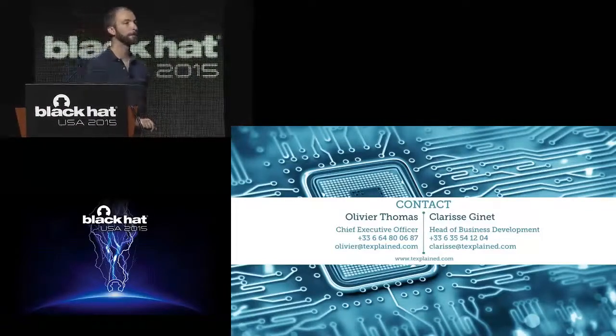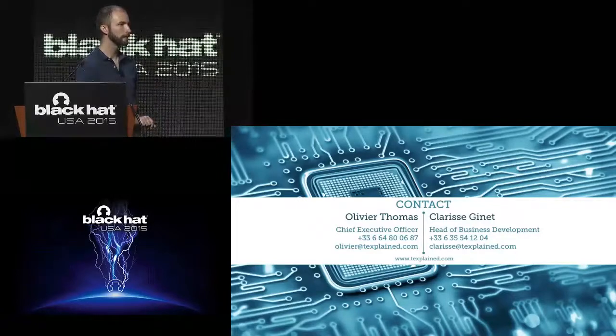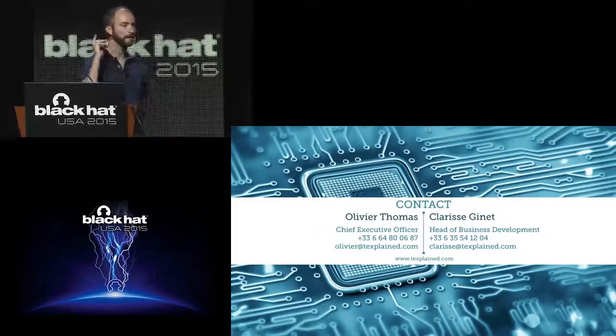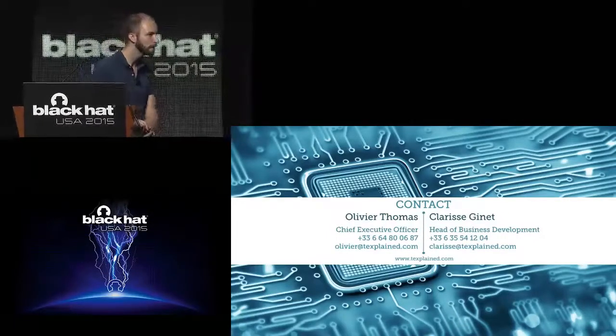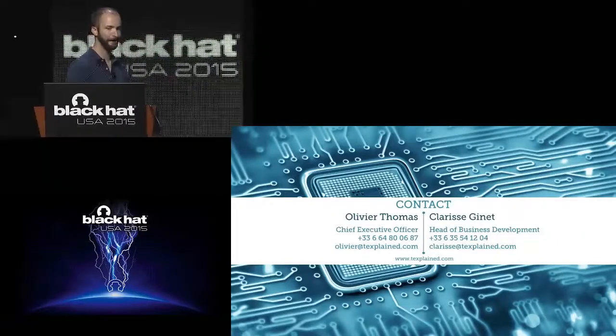A question about your deprocessing methods. For delayering, do you have any particular trickery? I know a lot of people are using polishing or chemical delayering or lapping, but those tend to produce somewhat uneven results when you're trying to do a full layer image. Do you have any approaches to that? I think it's about deprocessing techniques, for evenly delayering something that's maybe five metal layers as opposed to three.